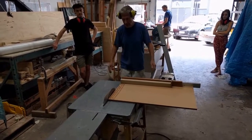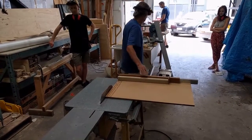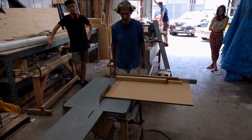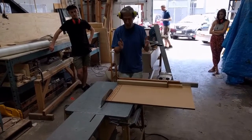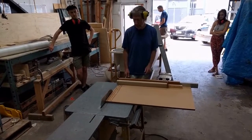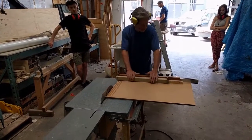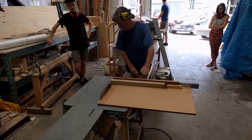Safety — keep your hands out of the way, that's what it's all about. Use a push stick. You can clamp the wood here. For repeat cuts, there's a stop block, and then you can do multiple repeat cuts at the same length. One of the advantages of this is you can start chewing away quite accurately. The finish on the end is pretty good for most standard quality. Stand behind it, keep away from the side. It's pretty safe — I've never had any trouble with a crosscut. Obviously all the forces are in your favour.